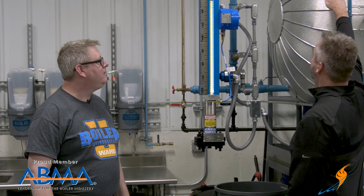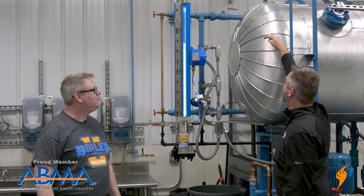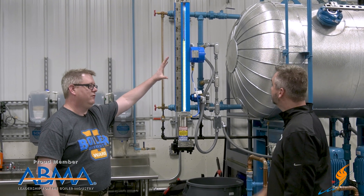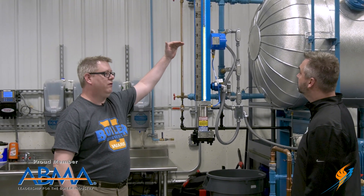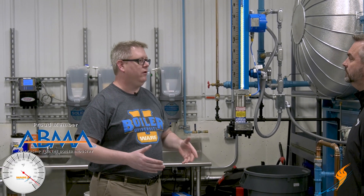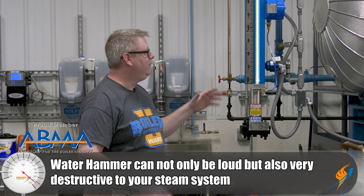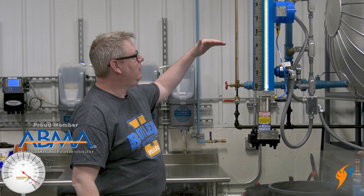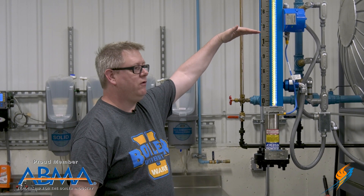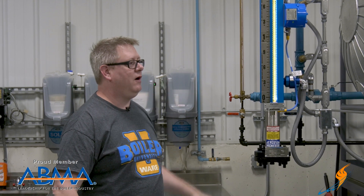What happens — let's start with why is it that the level on the tank needs to be right? Well, if we've got a deaerator, part of that volume is full of steam and part of it's full of liquid. If we overfill that and we've got only liquid, we're really set up for a hammer event where the introduction of steam can cause hammering and shock waves and cause damage to the tank and equipment. So we want to maintain this so we know we've got enough water to feed the boiler but not so much that we're going to cause a problem with the tank volume.